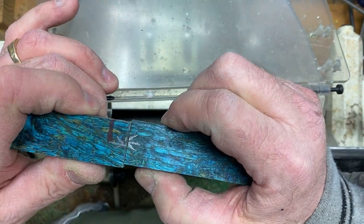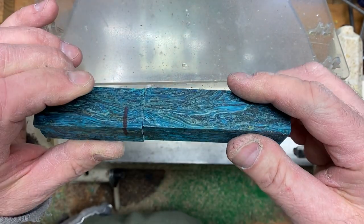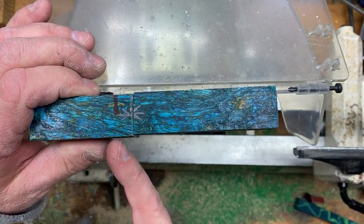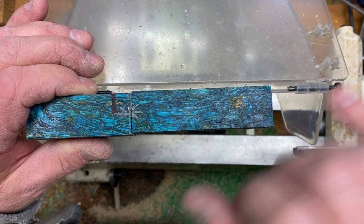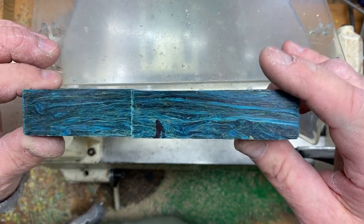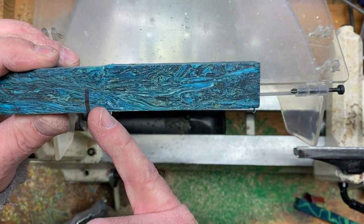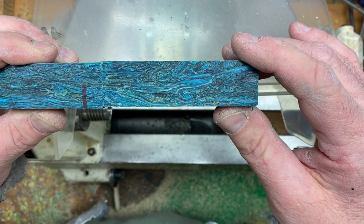Dry fitting our components, you can see where we cut the two blanks apart. It's not too bad — we have a relatively tight fit. In retrospect, what we should have done was squared our blanks first, cut them in half, and then squared the face where we made our cut to the blank. Then when we drilled our holes, we would have had a perfect match. It's not an issue — we'll put these on the lathe, true them up, put them in a collet chuck, and face them off where the components meet.